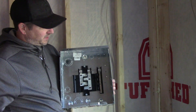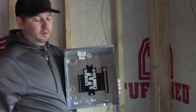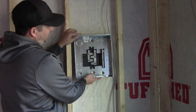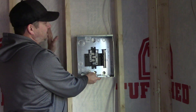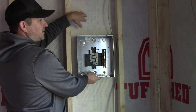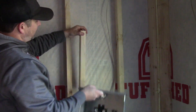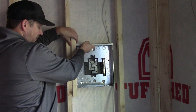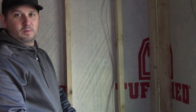Here's the box and what it looks like inside. I'm going to install it about four feet up. Because this is a tough shed, I don't have a wall to put it up against — this is actually the external wall. So I'm going to put up two-by-fours first and then mount the box to those, that way it'll be nice and secure. Let's go ahead and get this thing installed and put the breakers in.